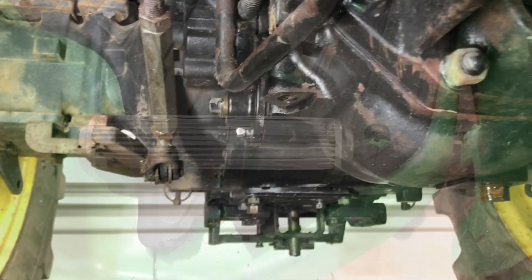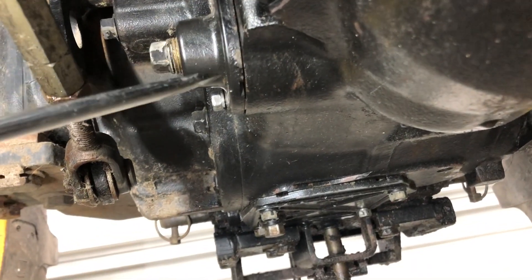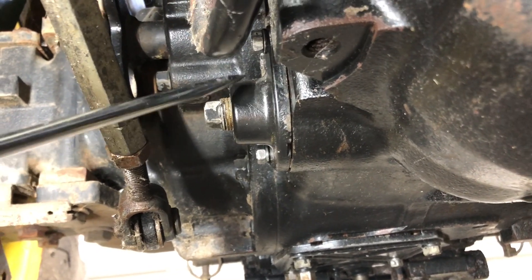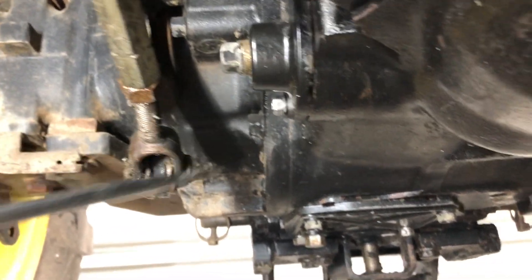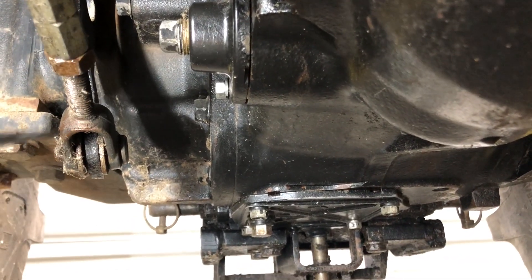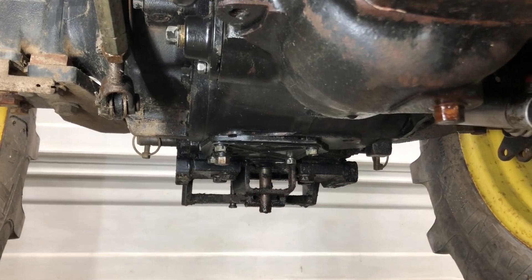That screen is on the left side of the machine. There is a plate with two bolts and a drain bowl in the center. You pull the drain bowl to drain all your fluid, then pull the two bolts that hold the cap on the screen area. The whole assembly comes right off and then you slide the screen out — it slides right out, nothing you have to take apart to get to it. On the 4710, they have this screen on the opposite side from the suction tube, which is nice.